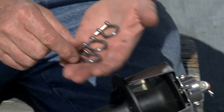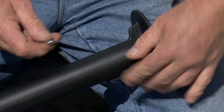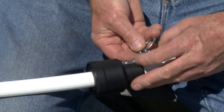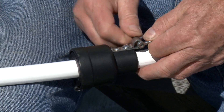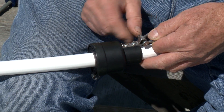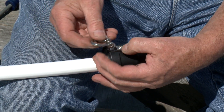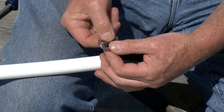The final operation is to install the three shackles: two of which are on the swivel and one goes onto the tack fitting of the drum. One shackle goes on the bottom of the swivel and gets attached to the sail; the final shackle gets attached to the top of the swivel and that will be the attachment point for the halyard. At this point the furler is complete and ready to go back on the boat.